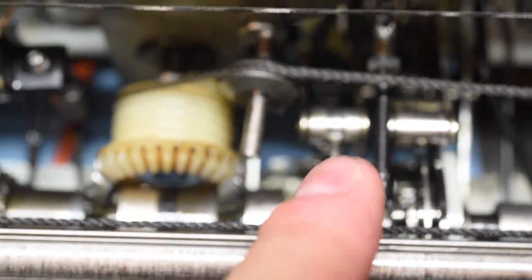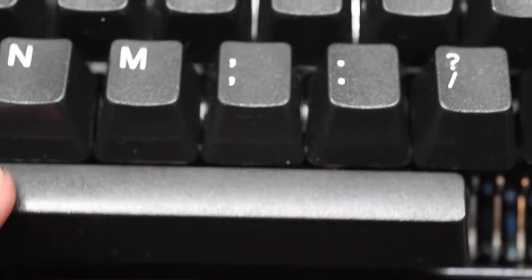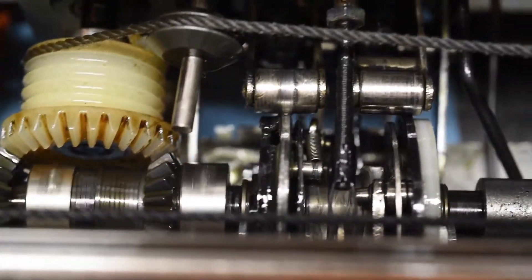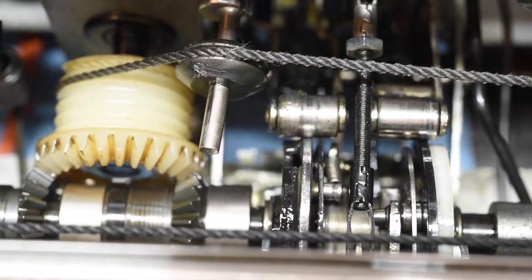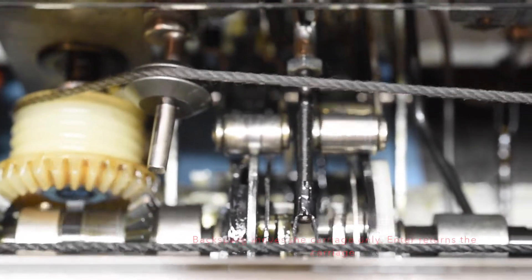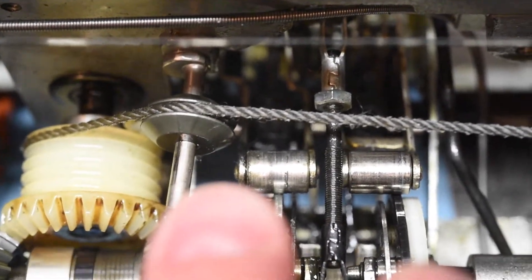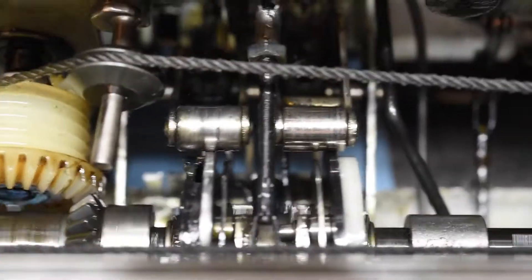The one to the left is simply the space cam. You just press the space bar, and you'll actually end up moving this cam. So if you look at this cam on the left, it actually does a full rotation — it actually engages the carriage every single time to go one space. Press Backspace, it actually engages it one notch. If you press Enter, it does a different rotation. These two cams are specifically used for moving the carriage and moving the carriage alone. They engage the actual carriage mechanism to either space or return.